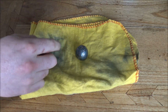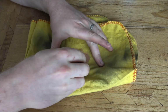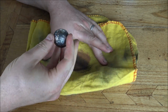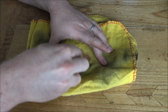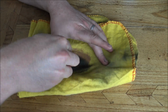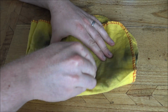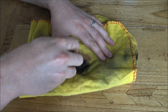It comes in a foam form like this, and you just rub it onto your yellow duster cloth, and then off you go. And it's basically a simple case of just finding the right bits on the globe that you haven't done yet and polishing them off. And it is a pain polishing a globe, let me tell you, because if you're doing a flat piece like a bar, then you can just do the one surface. You know you're going to cover pretty much the whole surface, whereas with a sphere, as you can see here, I've done little bits of it. You have to do the whole 360-degree plane in 3 dimensions as well, so it can take a little bit of time to get this done perfectly.